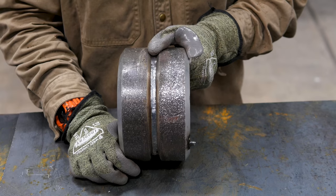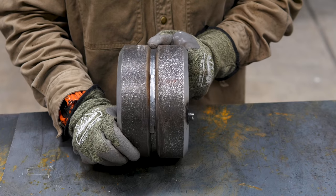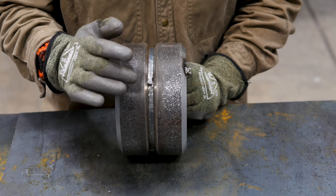This was my very first time welding with Modified Short Circuit in the 5g position, and as you can see from the face of this root, it's not too bad — only just a little bit of overlap where the two beads tied in.